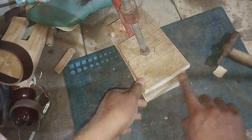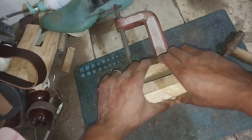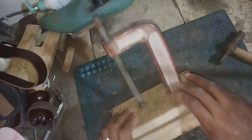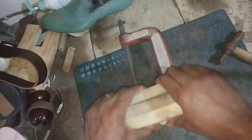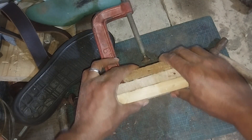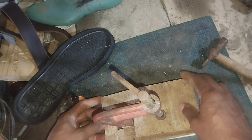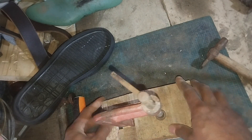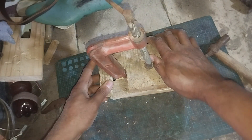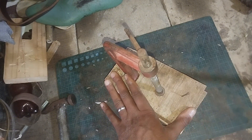So that I can fix it in like this, and then with some nails I can secure this top one onto that base. However, before I secure it I have to cut a channel where the metal of the C-clamp — the base of the C-clamp — can actually insert into this top plank, otherwise it won't sit flush with the rest of the base. Now you can see it is flush, sitting flush, because I cut this channel underneath so that part slots right in. And with that the base of my leather stamp press is done.